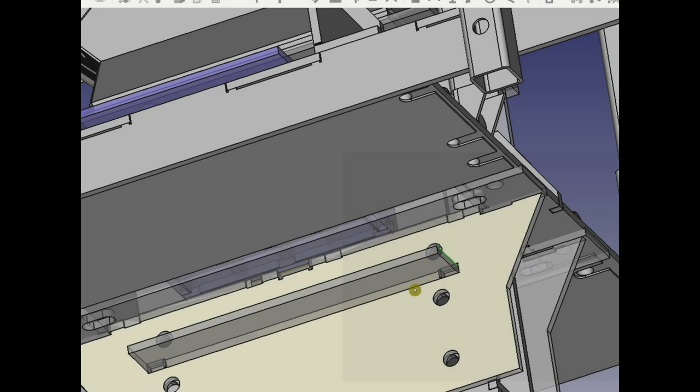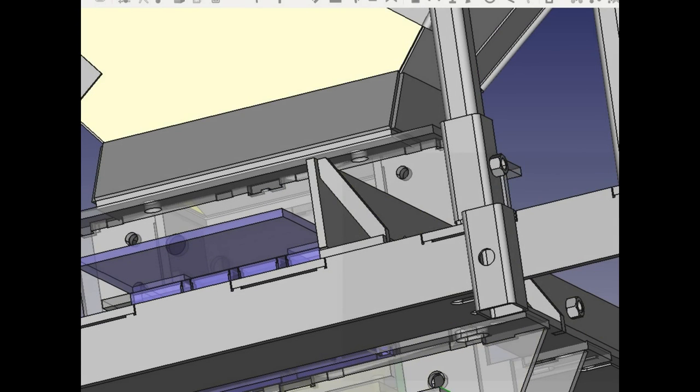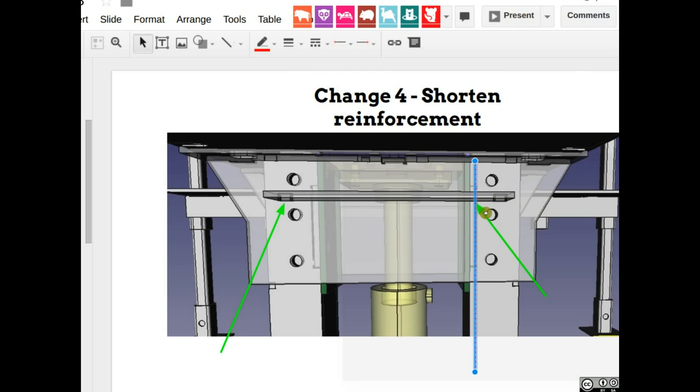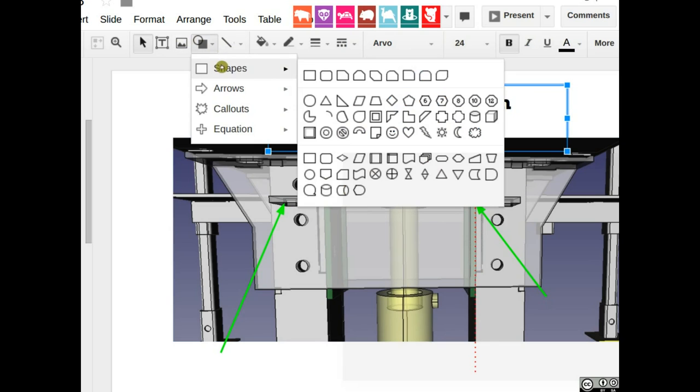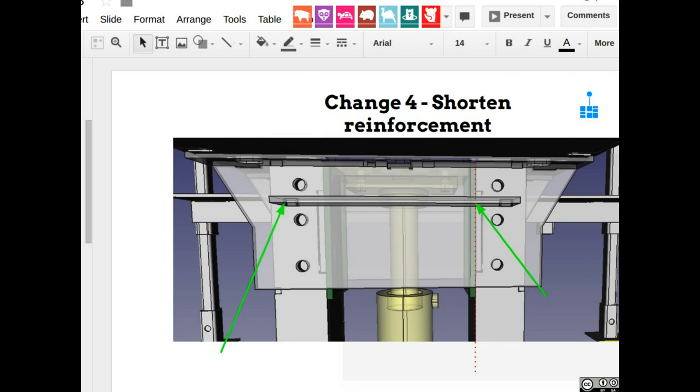So that locator hole would not have to move over left, because it would not exist anymore. So do a small locator hole right there, but don't make it go inside the chamber. Make it a 1-inch, I'll just draw that in as a little square in there. But we need that locator hole. It makes fabrication easier. In Japanese, that concept is called poka-yoke, where you use features of the machine that prevent the thing from being built the wrong way. So basically make that little notch in the plate happen right there instead of there, since that's going to be cut off. That's a locating hole that this front piece goes into, and it's welded after that. So those are the two changes required there.